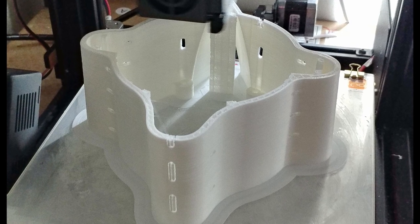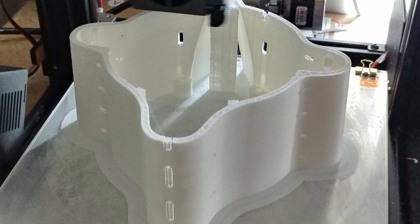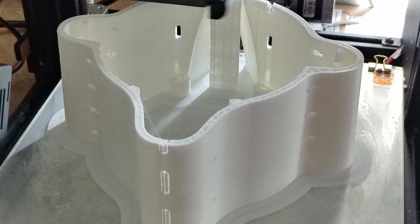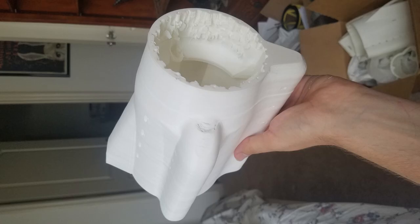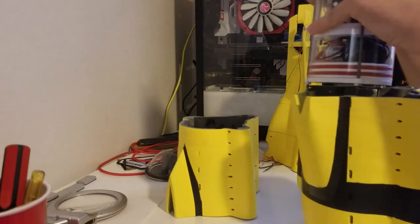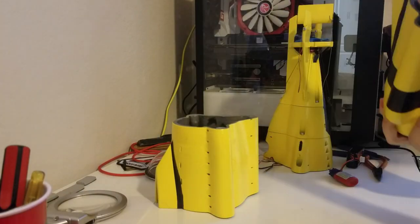Each part has been printed separately. They have a little bit of changes to their orientation, but for the most part, they build upright. So all of those layer lines are kind of the same direction, and finishing it and post-processing are actually kind of a breeze. The parts bolt together using one of my newer favorite things, which is melt-in 3D print inserts.